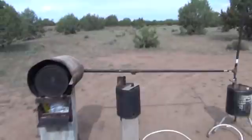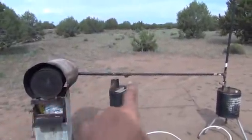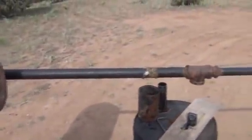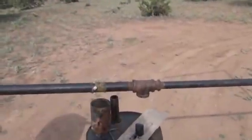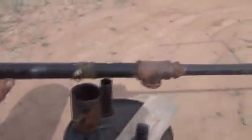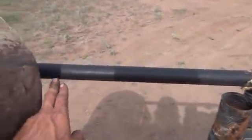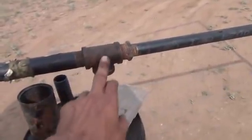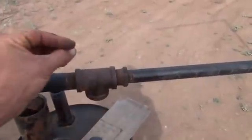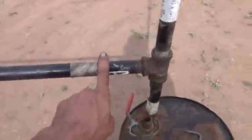Let me back up and show you why it's working this way. If you notice here, there's a downward slope to that pipe going through there. It's working opposite of thermodynamic pressures, and what that's going to do is actually force the smoke to release as much of this crude as it possibly can, because it's actually wanting to go uphill. By forcing it slightly downhill, we're forcing a lot of that heat energy out, making sure it's releasing a lot of that creosote or bio crude. It also allows the creosote to roll down the bottom of the pipe, hit our T-block here, and run down into our first collection container. This is a reducing point right at the capture point — this will help restrict the pressure and focus our first capture. The gas gets refined and reduced slightly in volume through the system here.